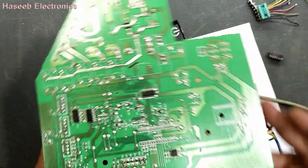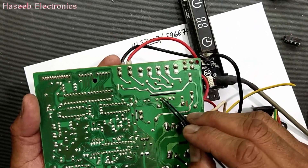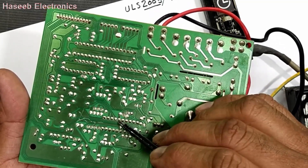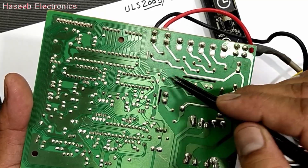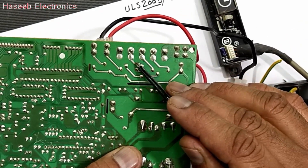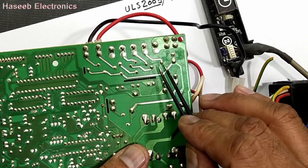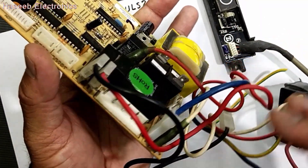So let's discuss the circuit. It is a 16-pin IC; these are the relay drives, the coil voltage. These are coming from this IC, and this IC is connected to the microcontroller through these lines. So the microcontroller will give a signal to this IC, and this IC will apply a drive signal to the relays. The relays will switch between the phase and the output. These are the relay contacts, but the coil side is here — the relay coil will energize from here and make these contacts — and we will take the output drive signals from 220 volts.